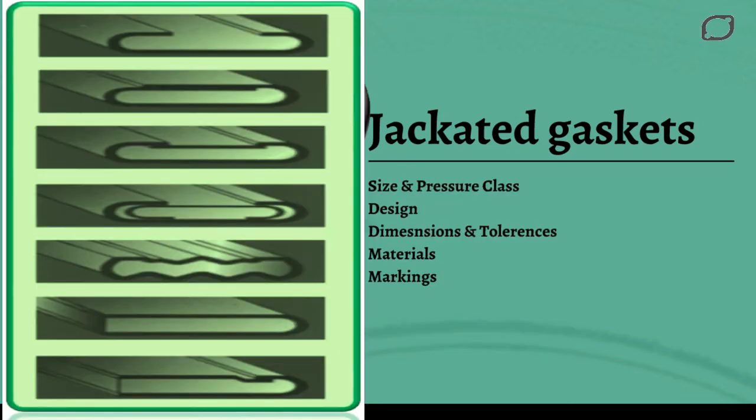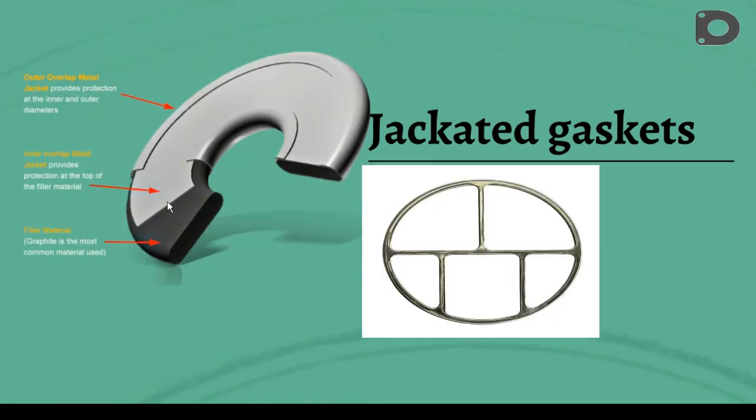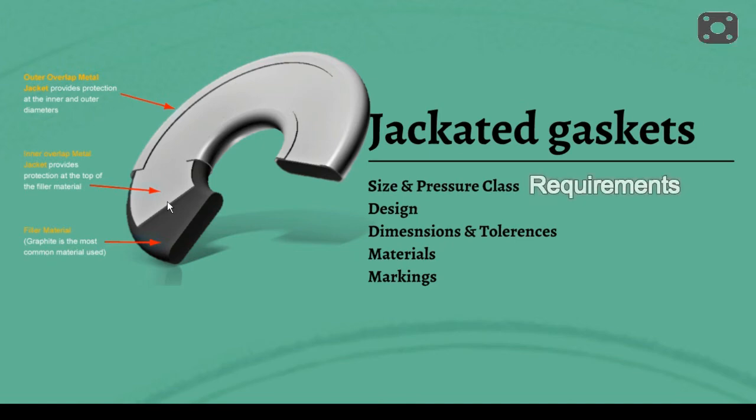Metallic gaskets can come in different styles like double jacket, single jacket, or solid metal. Soft compressible filler material can be flexible graphite, PTFE, or non-asbestos compressed sheet type. The design of a metal jacketed gasket also may require different shapes, and the styles mentioned above can be made to a variety. The standard filler is normally sufficient for applications up to 900 degrees Fahrenheit. Other soft fillers are available for higher temperatures or special applications.